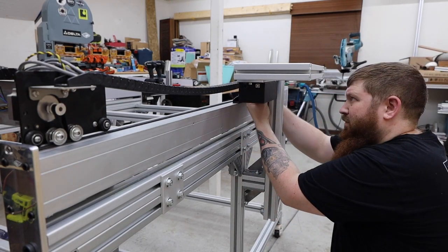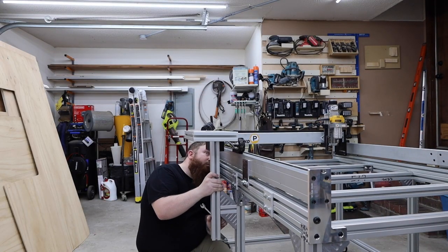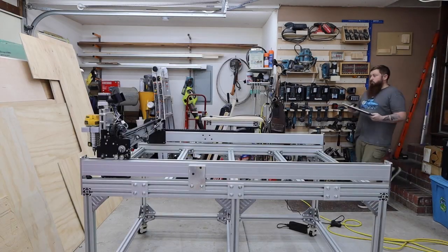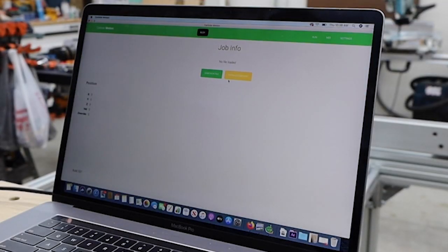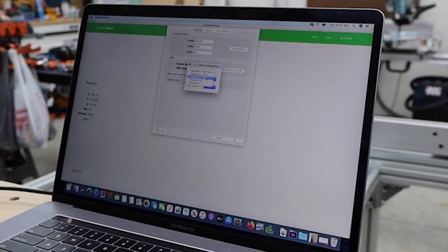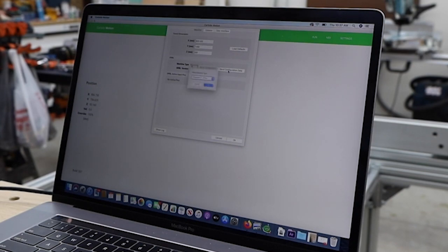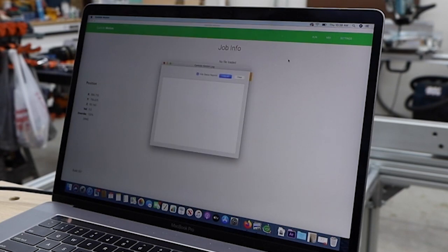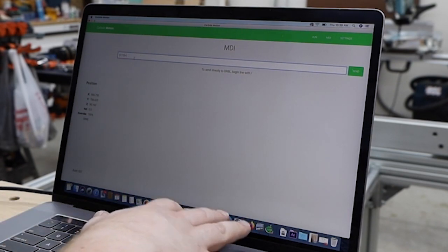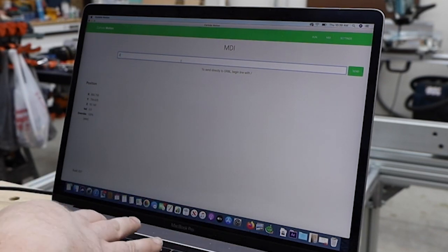I plugged everything in and adjusted the height of the laptop mount. It's just about ready to go, but first we need to make some adjustments to the programming. The latest version of Carbide Motion allows you to input custom machine sizes. I settled on 870 for X, 1450 for Y, and 200 for Z — start low and work your way up. Next I went into the MDI and had to make some changes; I have a whole video for this that I'll link in the description. Basically I'm changing the steps for the Z-axis since I have a CNC for Newbie Z slider, the max homing speed, and the max rapid speed.